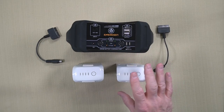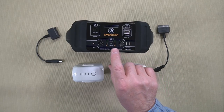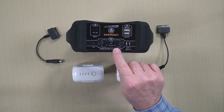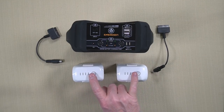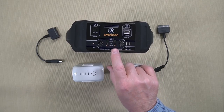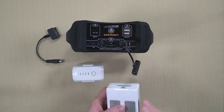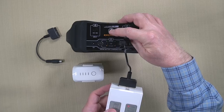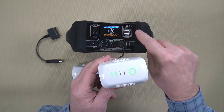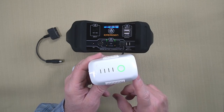What I like to do is, before I turn it on, adjust the two switches for the type of batteries I'm going to connect, then connect at least one battery up so I've got a load to keep it awake. These two switches determine the charge level for the dedicated ports — this switch controls that port, this switch controls that port — and you've got a choice between a four-cell battery and a three-cell battery. Since these are Phantom 4 batteries, which are four-cell, I want both switches in the up position or the four-cell setting. Then I'll connect up the cable — it's got a flat spot on the top that should point up because it's keyed. Once I slide that in and connect it to the battery, I tap once and then hold it, and you can see it's already charging the battery. When the battery's fully charged, this unit will turn off — it doesn't stay on if it's not charging something.